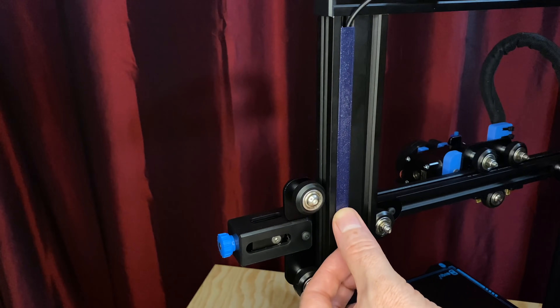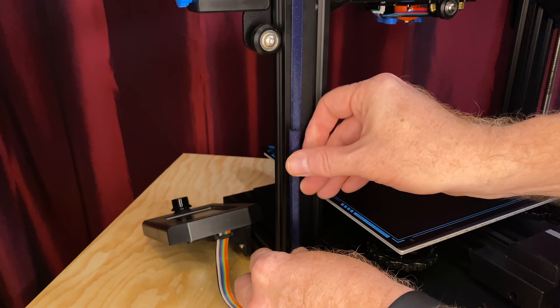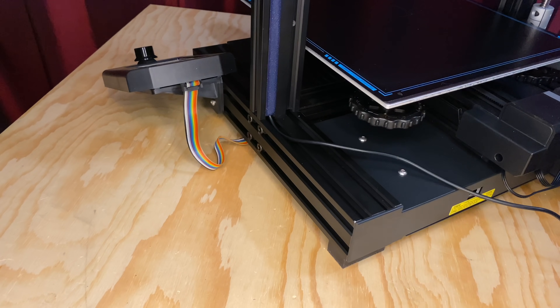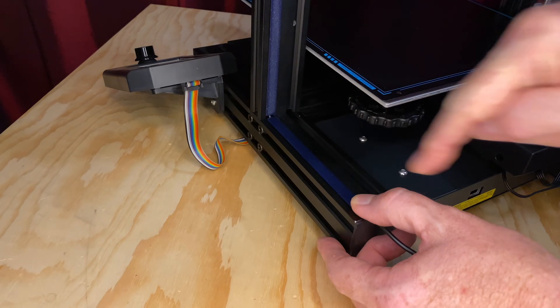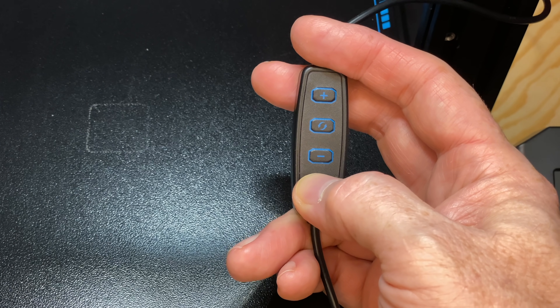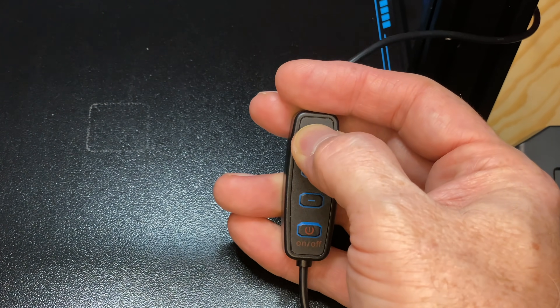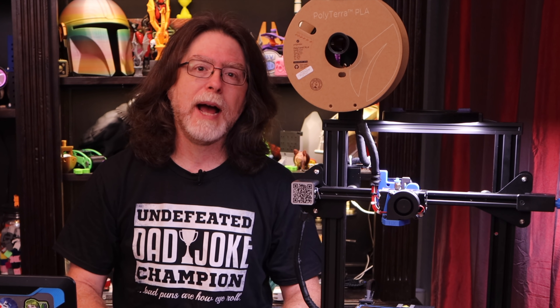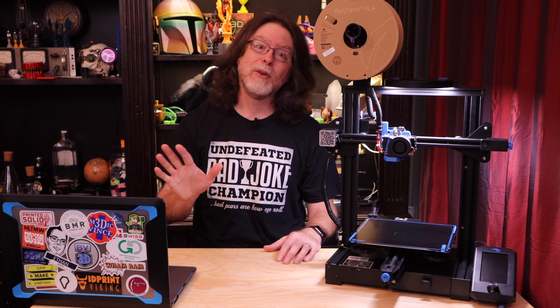We've got the ring light installed, so the next thing is to route the cable inside one of the channels in the aluminum extrusion and snap those covers in place. I started at the top and worked my way down. With the way the covers are sized, there's plenty of room for the cable to enter and exit the channel. With the ring light plugged into a USB power adapter, you can turn the light on and off and cycle through the different color temperatures and adjust the brightness. If you want, you can use double-sided adhesive to stick the buttons somewhere on the printer, or print something they can snap into. You can brighten your day with this simple solution for under 10 bucks — and as usual, links for everything are in the description.